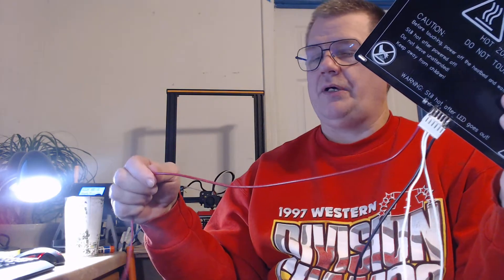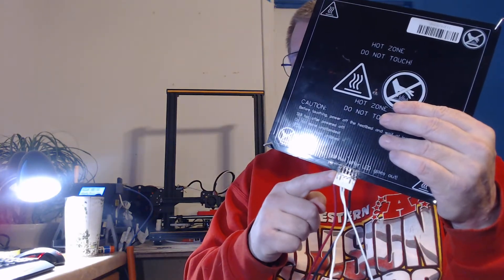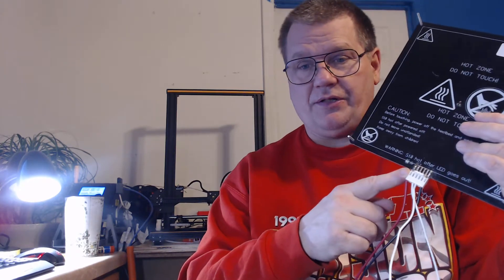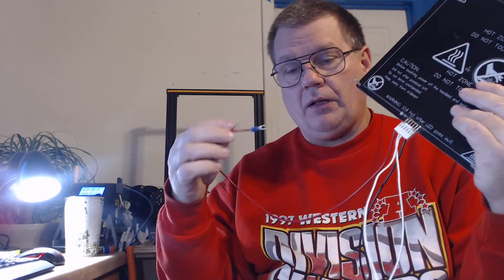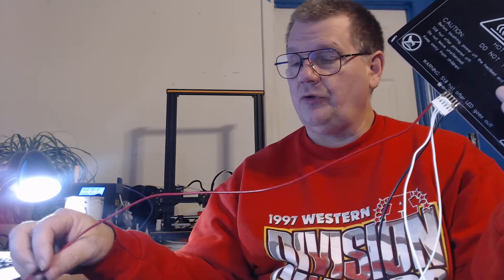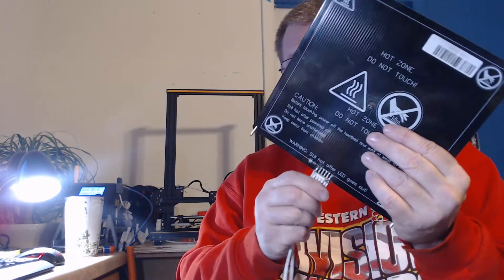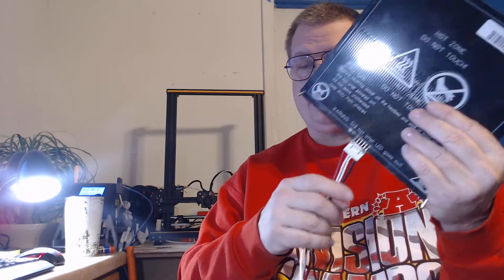This wire that I've put on here is capable of carrying the 12 amps that this can require, but this connector is not. I'm not even sure the wiring that comes with the Anet can either — I tried to tin that wire and the insulation melted in a big hurry, so I was really leery of using the wire that came with the original Anet. I replaced the whole thing. I don't have my Anet here — I actually dropped it on the floor and broke the frame, so I'll get a steel frame or build an aluminum frame and rebuild it. Anyway, I went and bought some UL-listed wire, some better quality wire, and redid the fitting. But that still doesn't fix the problem.